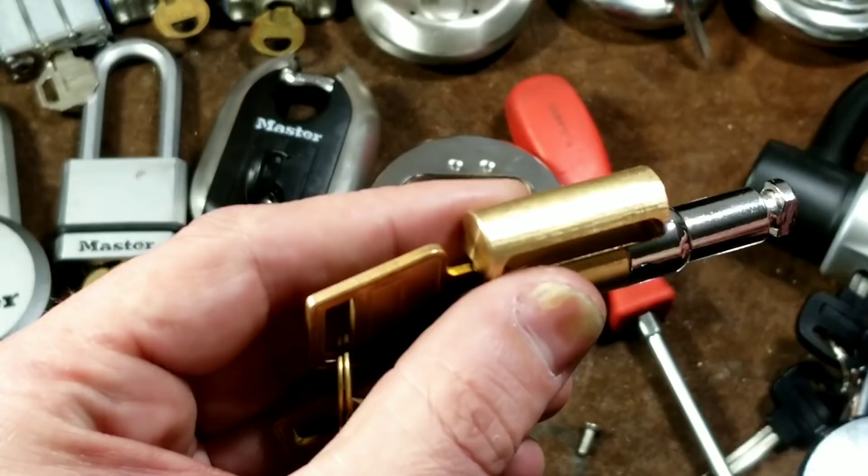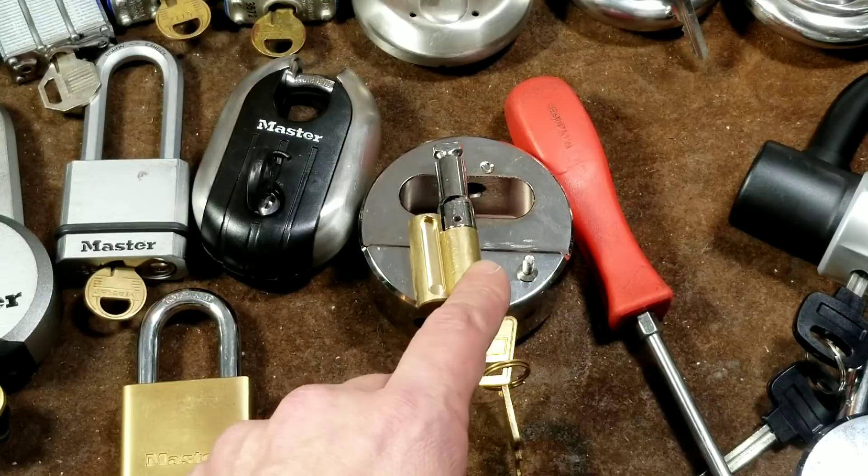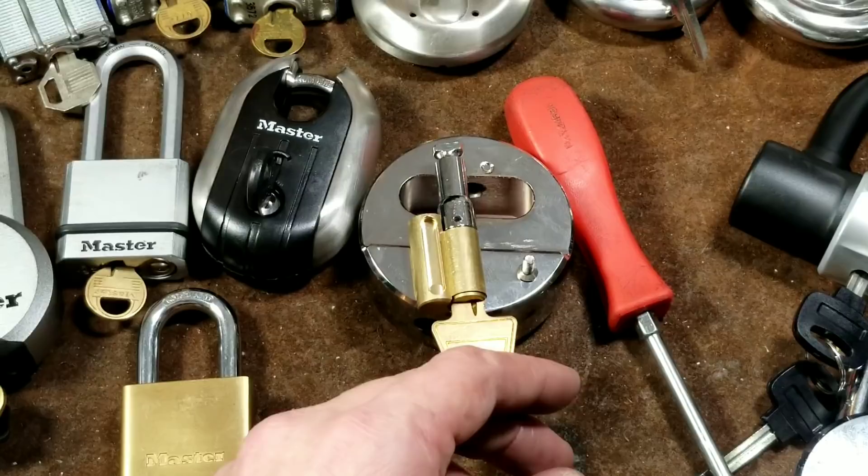You could also push a piece of shim stock up through the back even before you turn anything with the key and just press up on that pin until the shim stock slides forward, then put in the key and turn it counterclockwise about five degrees and pull out the core. That's the trick to getting these particular locks apart, just because of the way they mill out the lock core — the actual rotating part. You can ruin the lock if you don't do it absolutely right.